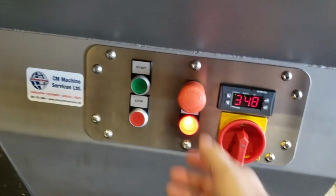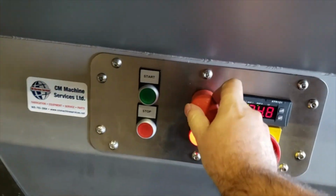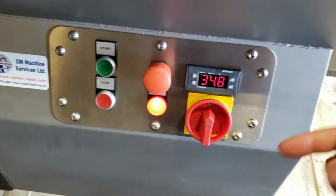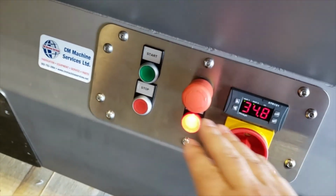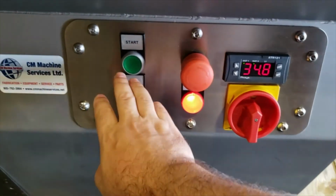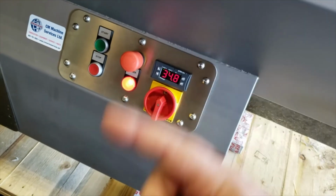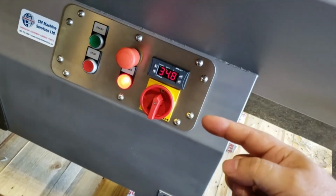It just means that you need to have this part out here, and not, see, that means it's stopped. When it's pulled outwards, the heating elements will kick in. You're preheating the water so that it gets to the level of 100 that you've preset by going up and down, then you can just press start. The machine will work for 10 minutes in one direction, 10 minutes in the reverse direction, and the last cycle 10 minutes in the other direction.